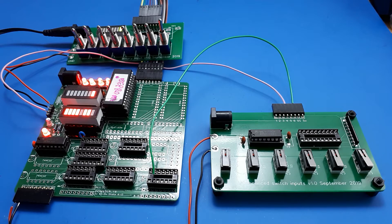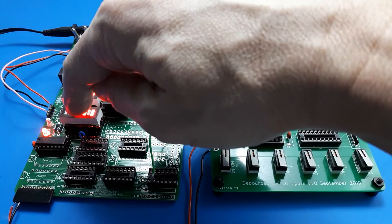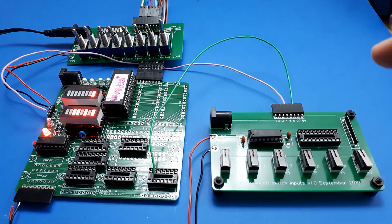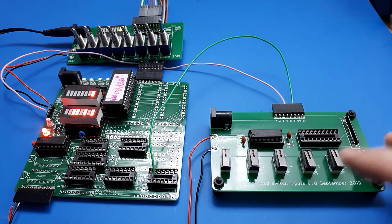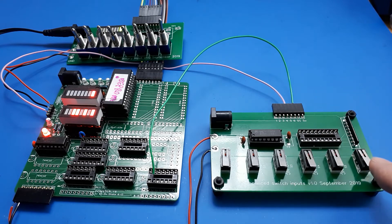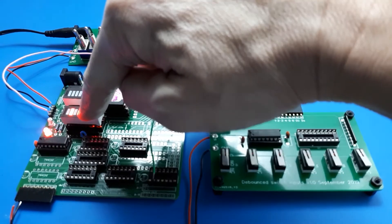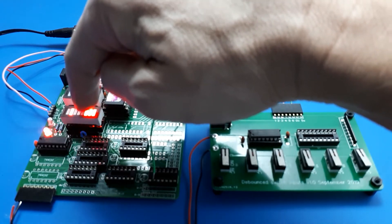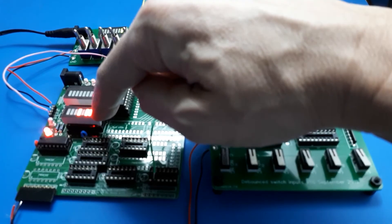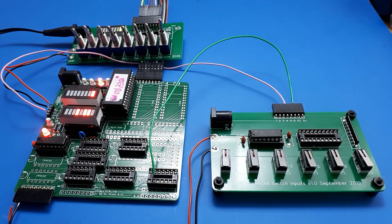Fetching has loaded the current instruction one into the instruction register, which is then passed to the EPROM and decoded to these bits here. The first four bits tell us which register is going to be publishing, and the last four bits tell us which register is going to be storing. So this would be publishing register 15 and storing to register six. Moving on to the next clock cycle, we'd be publishing three and storing in five — and that's the very first micro-instruction with all lights off.